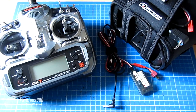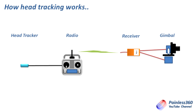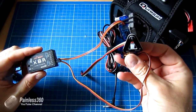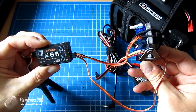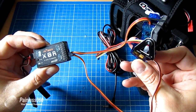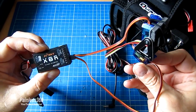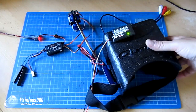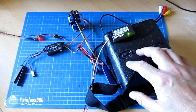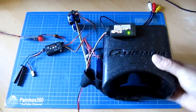Now we've got the wireless talking to the receiver, the next thing we need to do is talk to the servos. The servos themselves just connect into the receiver via any of the spare outputs you've got configured. So you might configure a radio so that channels 1, 2, 3, 4, and 5 are used for flight controls to your flight controller, and then input 6 is used for your tilt servo and input 7 is used for your pan servo. So now as the head tracker is sending information to the radio, the radio sends that up to the receiver, and the receiver is driving these two servos to move the camera around and look in the same direction as you're looking with the goggles.